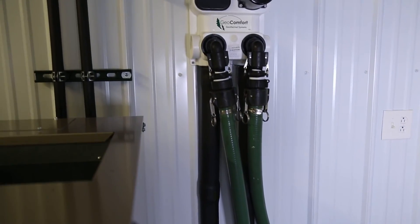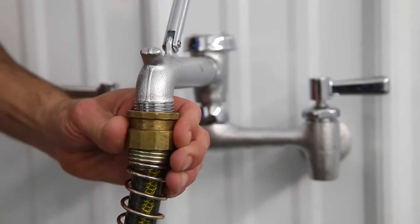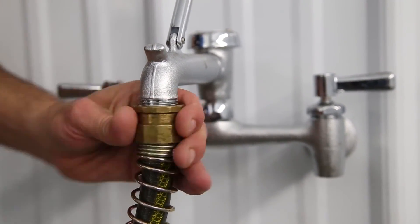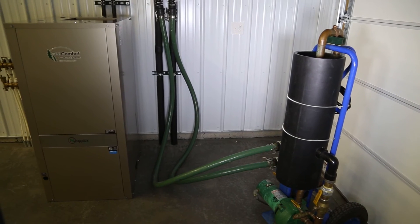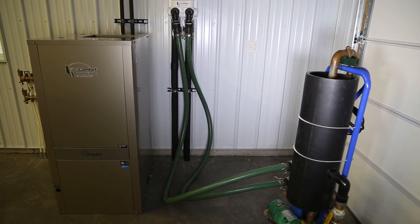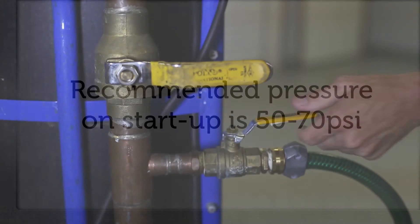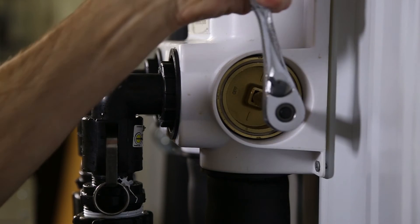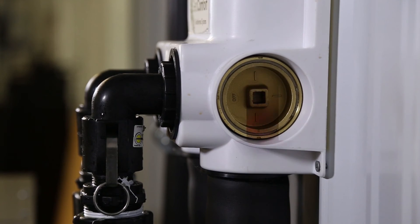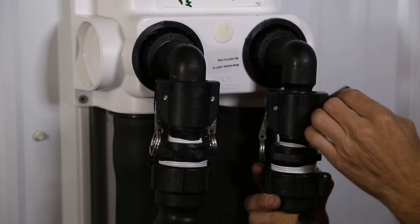Now that the system is isolated from the reservoir, the pump can be turned off. Do not open the main flush cart ball valve yet. We use city or well pressure to stretch the pipe and get maximum pressurization. Connect the water supply back to the discharge line hose connection and open the ball valve. Turn on the water supply and leave it on for 20 to 30 minutes. This will stretch the pipe properly to ensure that the system will not have a flat loop during cooling operation. Once the loop is pressurized, the recommended pressure on initial startup is 50 to 70 psi. Turn the water supply off. Maximum pressure should never exceed 100 psi under any circumstances. Turn the three-way valves on the flow center back to normal operation mode, which closes the flush port connections. Open the ball valves on the flush cart to relieve pressure on the hoses and disconnect the hoses from the flow center.